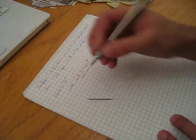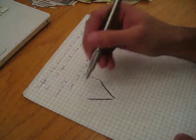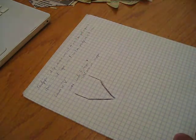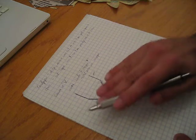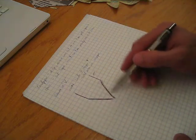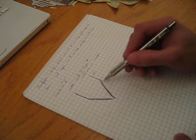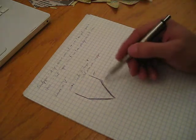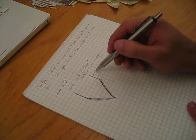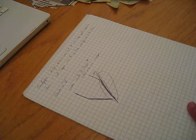If a V edge is like this — obviously — to sharpen, you lay the knife flat down and you're on this angle. Then you start to tilt the knife up to hit the edge properly. You go over this little bump and then you're on the edge. You'll kind of feel it because this edge is bigger — your contact area is this whole edge. That's your contact area with a V.